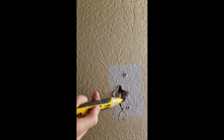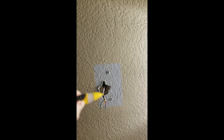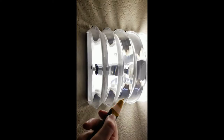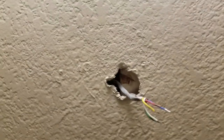That's a handy little voltage tester — it kind of just reads if a wire is hot or not. It makes a noise if you put it near something that's hot. It registered a little bit, but nothing like what the light registered when there was actually voltage. I had turned off the power at the breaker, which is a very important point if you're working with electric wires. Turn off the power at the breaker and use something like that — or preferably an actual multimeter — to confirm that the power is off.